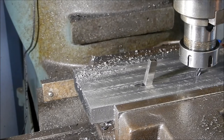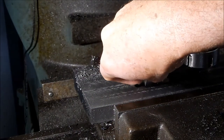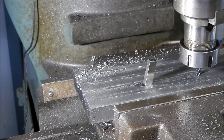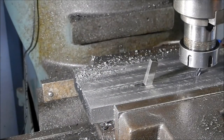At the moment I'm out to just on the gauge block. I've got a 6 and this is only just going in — it's a 1.36 plus a 6.5 which is around about 7.86, which is pretty much where I am on my DRO. My digital readout is showing this cutter is cutting extremely true. I'm going to come out to the 1 mil side cut on either side, so 6 mil cutter plus 1 mil either side gives me my 8 mil. We'll recheck that again — everything's looking pretty true.